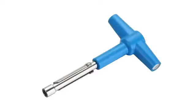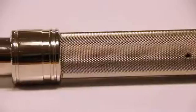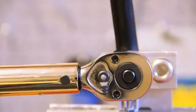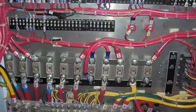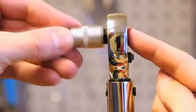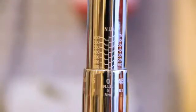There are many different kinds of torque wrenches available on the market today: beam, click type, electronic, simple plumbers, hydraulic, and deflecting beam. We elected to pursue the click type torque wrench. This is called a click type torque wrench because it produces an audible click when the specified torque is reached. With this design, you can also sense an impulse felt through the handle. It's got a ratcheting head calibrated both clockwise and counterclockwise, which provides flexibility in confined areas or when there's tight centerline spacing from connector to connector. The 3/8-inch drive comes with a quick release button for secure fastener retention and effortless removal. The micro-adjustable scale settings are in inch-pounds, which is the same scale already established for our connectors — no conversions required, making it quick and easy to set the value.